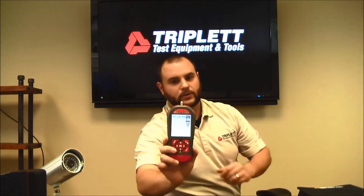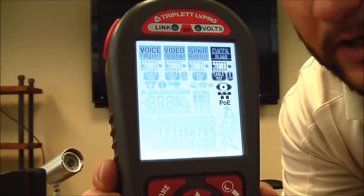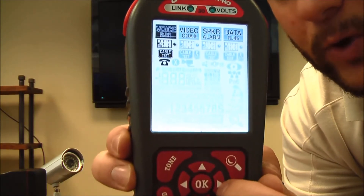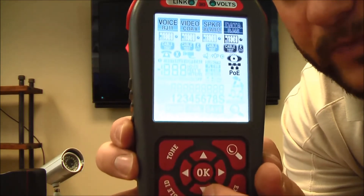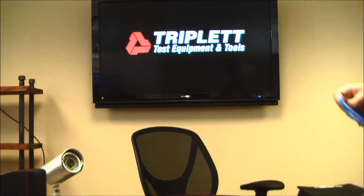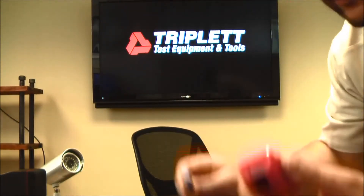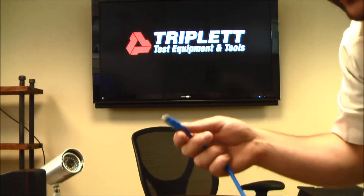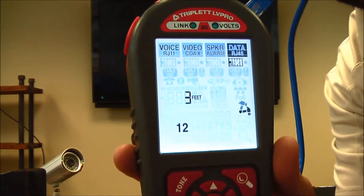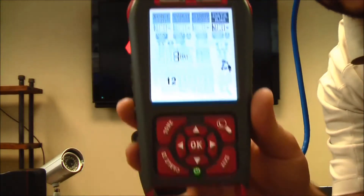The first test I'm going to show is the RJ45 data test — I'll measure a cable length of an RJ45 cable. I have a patch cord here. I'm going to take off the adapter off the bottom, plug that in on the other end, and plug that in on the top of my LV Pro. I'll press OK. The hammer icon indicates the test is running, and it's telling me the cable is 3 feet long on pairs 1 and 2. So if you need to know how long a cable is, just plug and play.